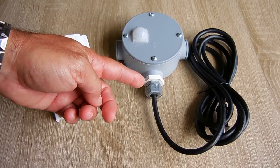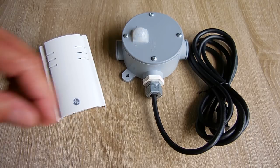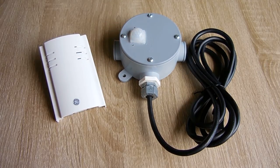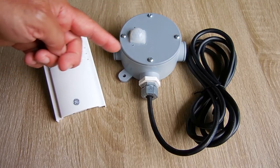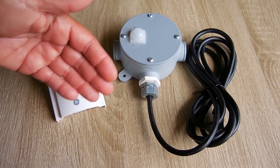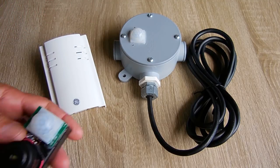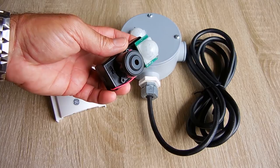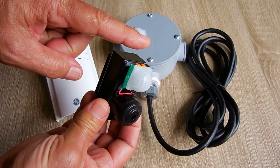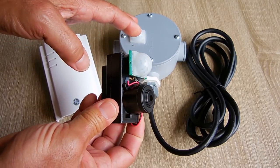You can hardwire it or you can use a wire like you see right here — I have an eight-foot cord, 18-gauge wire with only two prongs. I use a plastic box. If you don't want to hardwire this and have it run all the time, you never have to worry about batteries as long as AC power is on. If you like a portable version where you don't mind changing batteries every day or every couple of days, you can take the circuit for the PIR and modify it. You'll see the link to that video at the end as an end card.